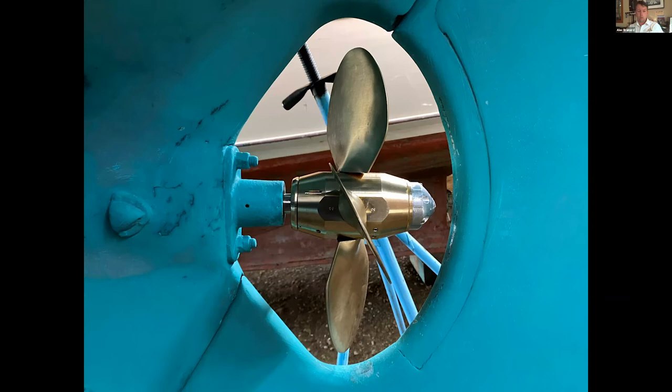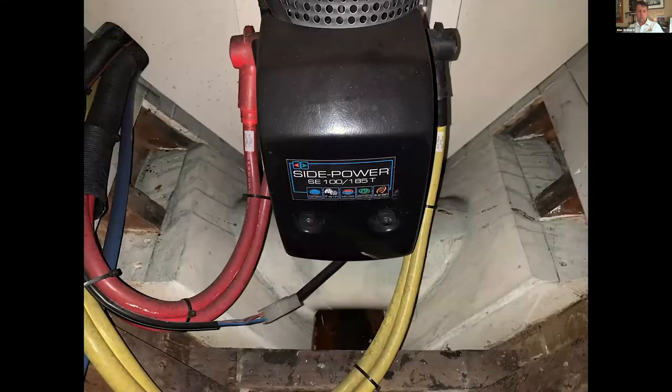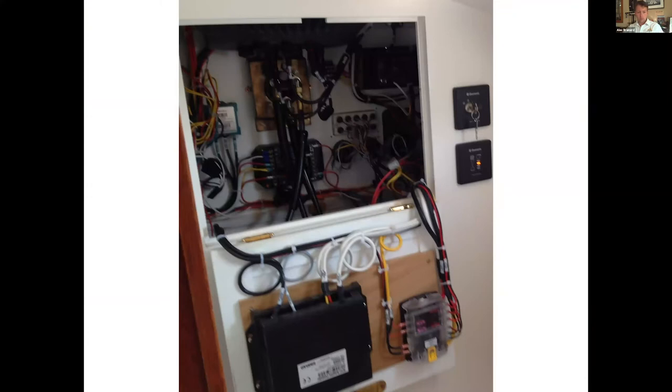When you get up to four blades it really smooths out the ride, and when you put the boat in reverse it actually stops — so it's been a common upgrade. This is a bow thruster installation we did on that Newbert & Wallace powerboat. There is a great way to install a bow thruster in a traditional plank-on-frame boat, and it actually involves caulking with cotton around the perimeter of the tube where it exits through the planking.